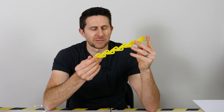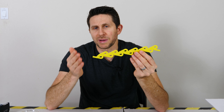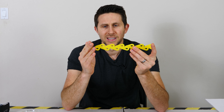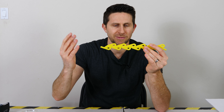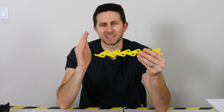So why would Tesla invent something like this? He actually filed a patent for it and was granted it. Well, it turns out that the Tesla valve actually works better for a gas than a liquid. In one direction there's hardly a pressure drop, but in the other direction there is a pressure drop, so it acts as basically a fluid diode. It allows fluid to pass in one direction but restricts it in the other direction, and it still causes a pressure delta between flow going one way versus the other. This can be useful in high-frequency applications.